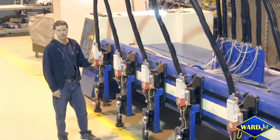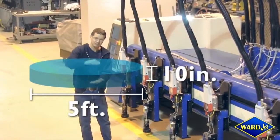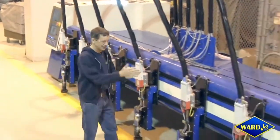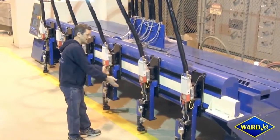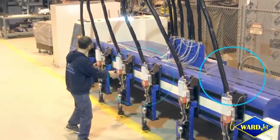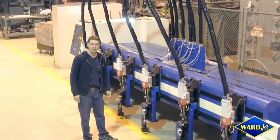The primary function of this machine is the customer wants to cut out five-foot diameter discs in about ten-inch thick material, and they'll be able to cut as many as they can as quickly as they can — hence the six heads. The concept here is that head one would cut counter-clockwise, head two would cut clockwise and be a mirror image, and as a result we'd be able to cut each half of the circle simultaneously, doing it three times with six heads so we can get three five-foot discs cut all at the same time.